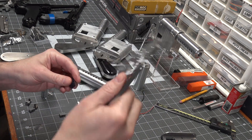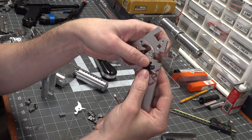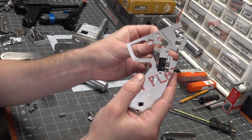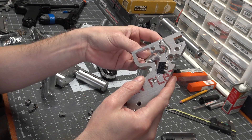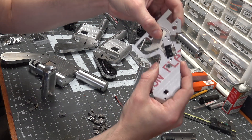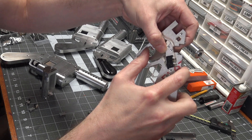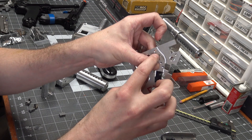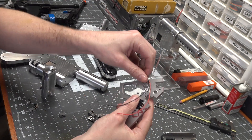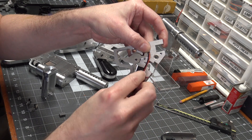So I designed out a little pocket and, as you can see, these will just fit right into my pocket here like so. I designed out the middle of the trigger so when you put it in place, you'll see when the trigger's pulled it's going to actuate the switch. And then there's room for a spring right here to keep pressure pushed back on that. I also milled a little channel in there so the wires can fit in there pretty nice and go right up to that switch.